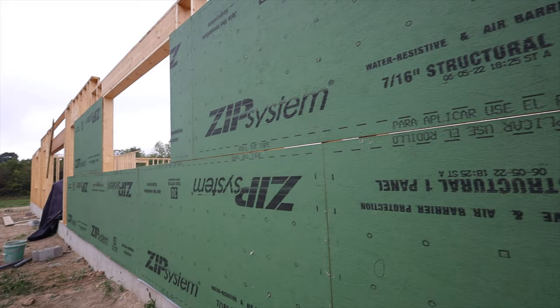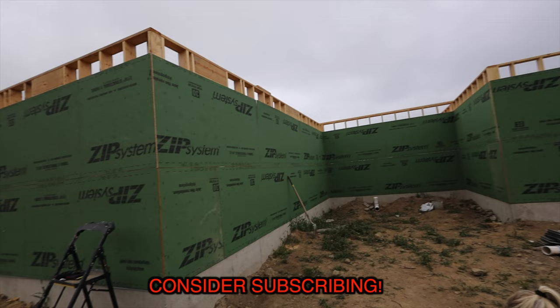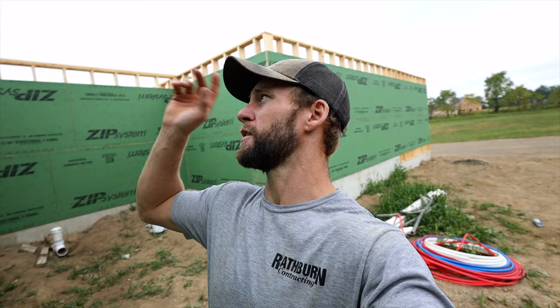I would say we probably have about a quarter of the sheathing done. Our nail supply is still lasting. This is exciting — it's starting to really show the shape of the house and it's really sturdying these walls up. You'll probably notice there are no windows cut out yet. There are windows on the house; we're just not cutting them out yet because there's more chance for rain to get through. So we're going to tape these seams — we have to go get more nails first. Our windows are just being stored at the lumber yard right now; we're waiting on two custom windows to come in. Then, once we get the trusses on — they're coming tomorrow to measure — this company comes out and measures the base of the house so that when the trusses arrive, they're exact.